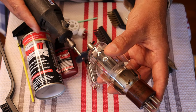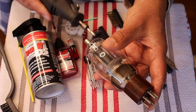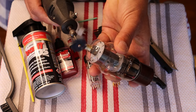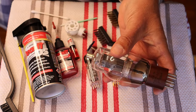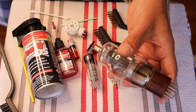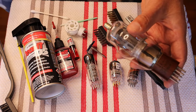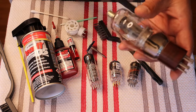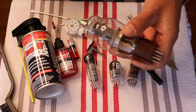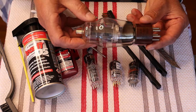You can come in with the Dremel like this. I wasn't putting any pressure on it at all because I don't want the wheel to bite hard — I just want it to touch it, basically. If you're new to this, I would be inclined to just go at it and take your time and just brush it until it's bright.